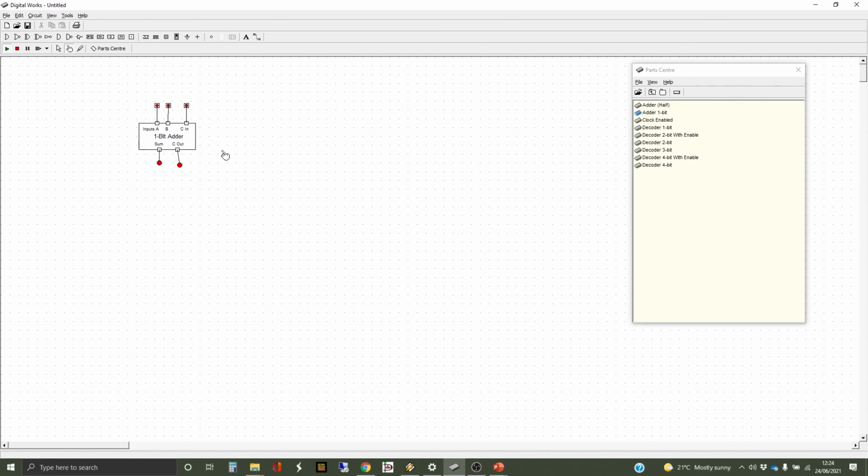And what are we going to do if we want to have binary numbers that are bigger than 1 bit? Well, the whole thing's been set up so that we can do this carrying process between the different bits, between the different columns. And so it's fairly obvious that we're going to be chaining several of these together to make a more than 1-bit adder. But that's the topic of the next video. So that's it from me for now.